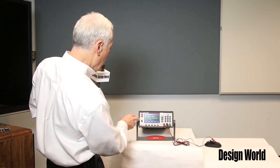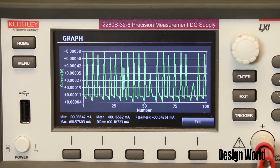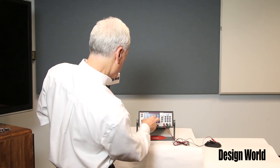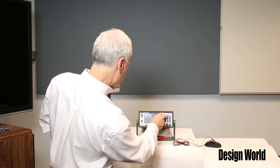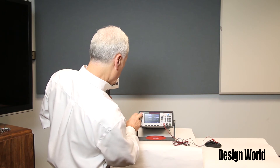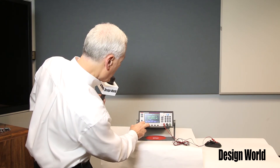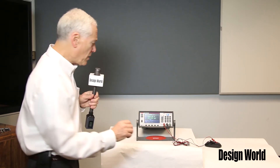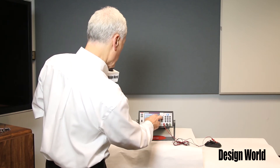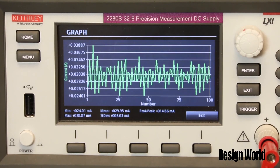Let me go back to the faster measuring mode because I'm interested in what's the maximum current when the device is operating. Let me go back to my measure menu and I will undo what I did. I'll use my keypad and go back to 1 power line cycle. So we'll start seeing the readings varying quite a bit. I'm going to go to my resolution mode and go to 4½-digit resolution, so I'll reduce the resolution but now I'm actually making much faster measurements. Let me activate the mouse here — move it around — and all of a sudden you see the current increases substantially. It gets up to 30 milliamps.